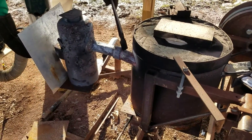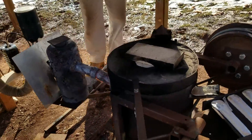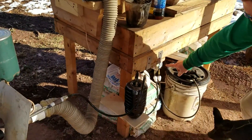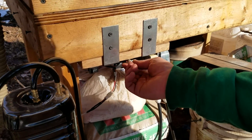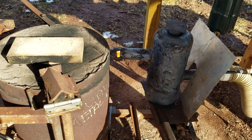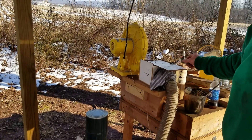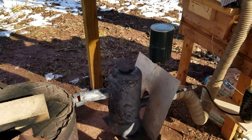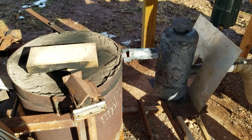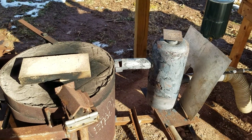I have to make a bigger collar here because the collar is a little bit too short. Basically what I do — see my peristaltic pump running here? I cut that off, keeping the air where it's at, and then the flame is going to start dying down. As the flame dies down, I'm going to start removing air from the system. See how the flame is starting to die down.